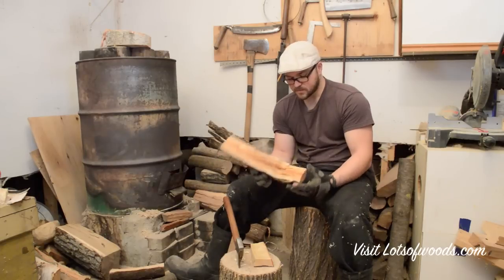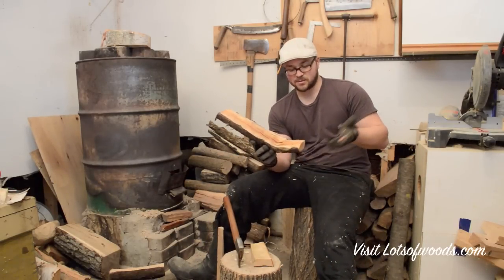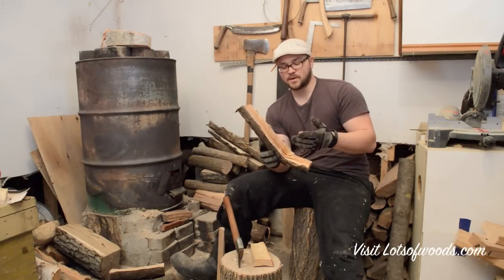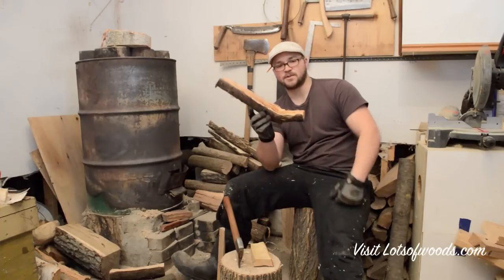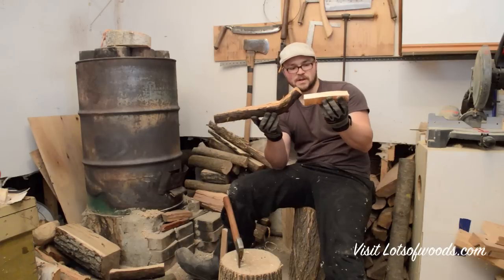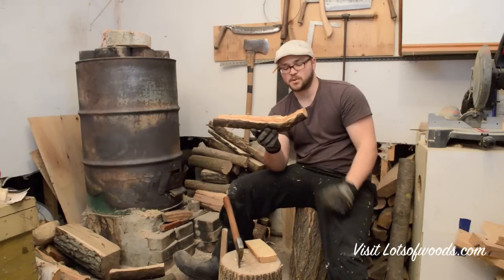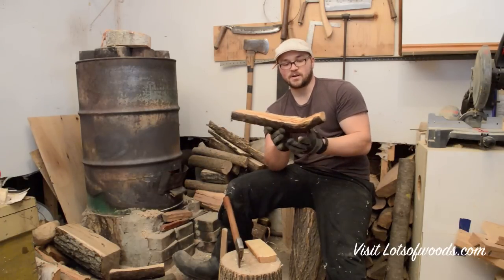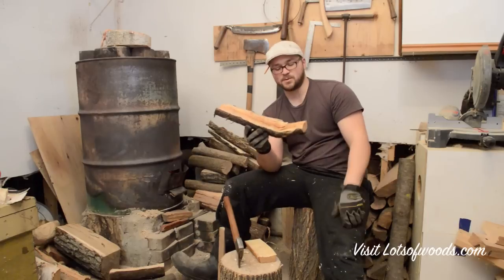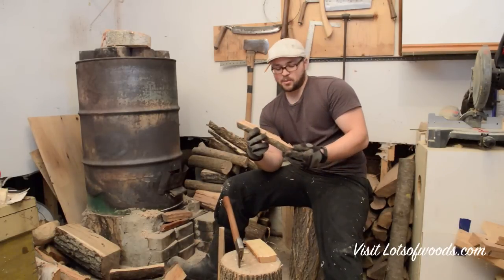This crook is interesting — if you're new to carving, a crook is just a bend in the branch. What makes it fun to carve is that the grain follows the shape of the spoon. You can't always carve this shape out of a straight piece because the grain won't flow with the bowl, making a weaker spoon. So if you're hiking through the woods and you find a crook like this, grab it, cut it out, split it, and there's your spoon blank — it helps with the side profile and gives you a strong spoon.